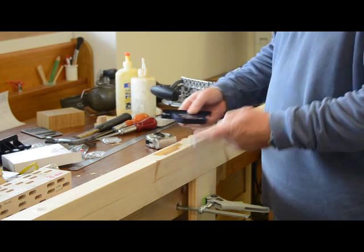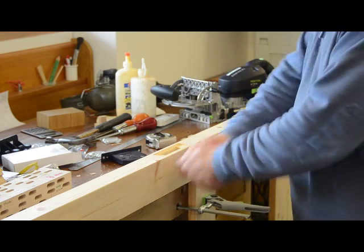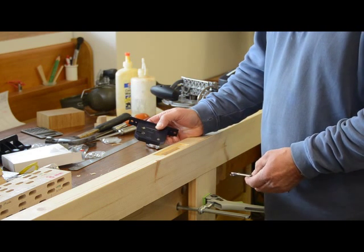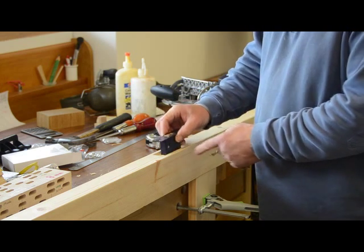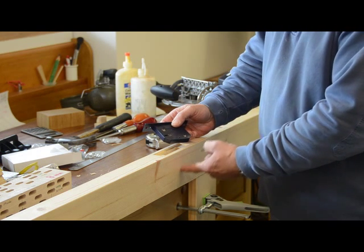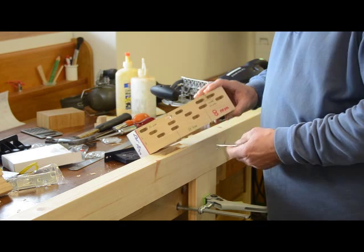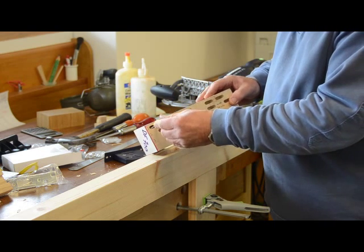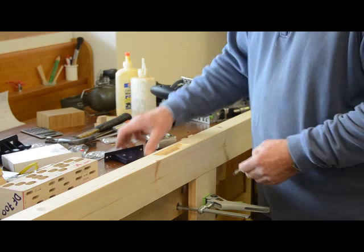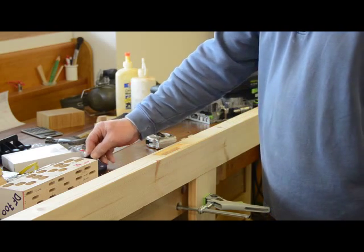Right, well, this being a mortise lock, it needs a hole for the key. Now, I could do it the old-fashioned way, which is mark it up and then drill lots of holes and wiggle it around a bit, but that's not terribly clever, and it's certainly not as quick as what I'm about to do. I've marked where the centre line of this slot should be, and I know how deep the centre of it is. And so why don't I cut a domino slot? And if I look at my reference block, a nice 8mm domino standard width will be perfect. So 8mm domino, in my case 49mm deep at that centre line, will do just the job.